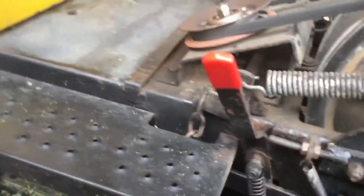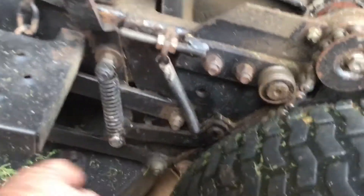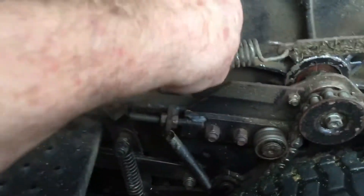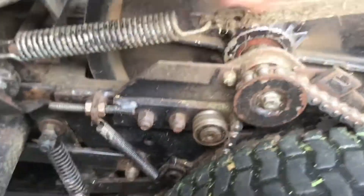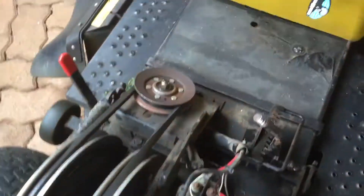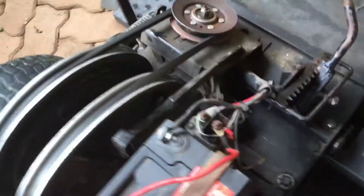Now, about that deck lifting — from there to there, just those chains, and there's adjustment on there for the left to right on the deck. All your fittings are nice and heavy, not worn at all. So you've got this spring — if you want to make the deck even lighter, here's an adjustment here. You just take that up, adjust that more, put more tension on that spring, less weight — easier for it to lift up for you. That's a very easy lift. See that — everything's simple engineering. It's obviously got a knob on it but I've got it off just to show you. So there it is.